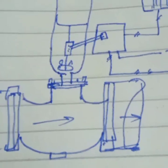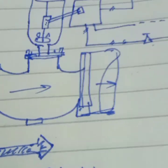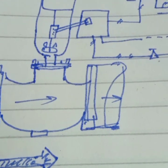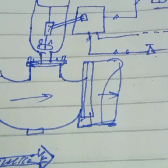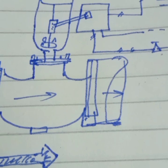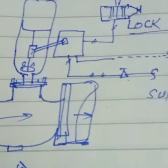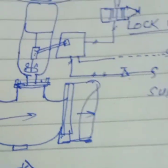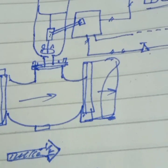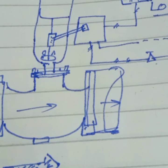The lockup relay is actually a device which locks air pressure. There are two types: one is the single acting lockup relay and one is the double acting lockup relay. The single acting lockup relay is used with a single acting actuator.